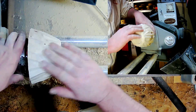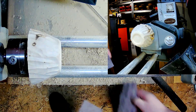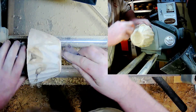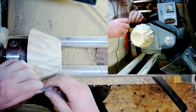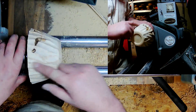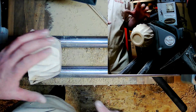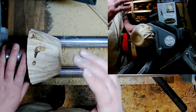I cleaned it out with the flap disc. Now I'm going to get some Abranet and roughly clean it up. I don't want it perfect — I just want to get rid of some of the marks. I'm not going to spend a lot of time on it, just a rough sand to get rid of some of the big marks. You can see the texture we've got now from the Proxxon, and then the little flap disc. I've taken it from 240 grit through 320 up to 500. Now we're going to get some colour on it.